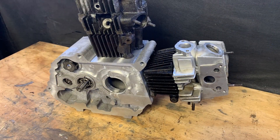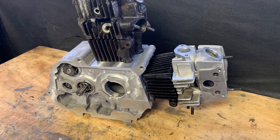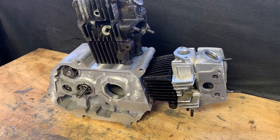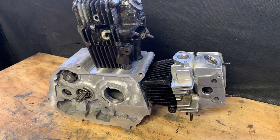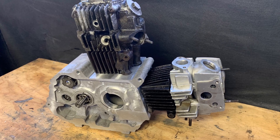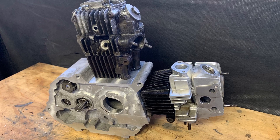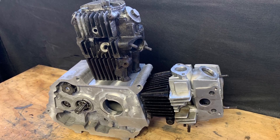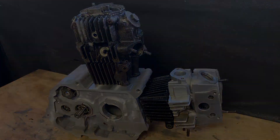And there you have it. All that's left to do is the easy stuff — I'm waiting on a reply from the heat treatment place about getting a crank pin hardened. Then all that'll be left is to machine the oil pump recess, fit the cam chain tensioner, widen the lower cylinders, get a cam chain, make a gasket, and sort the electrics out. Which shouldn't be too hard. See you next time, and don't forget to like and subscribe!